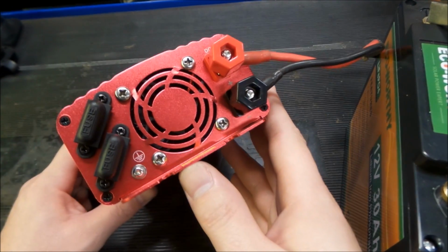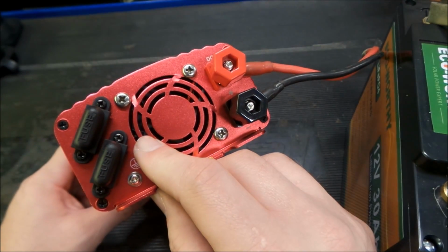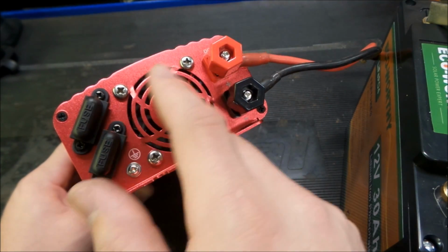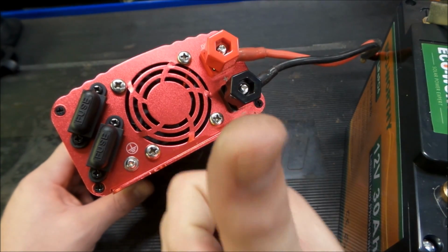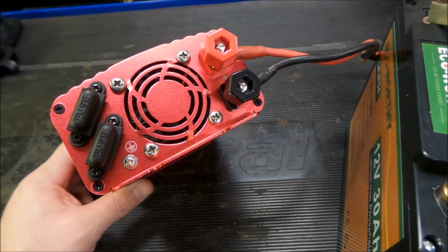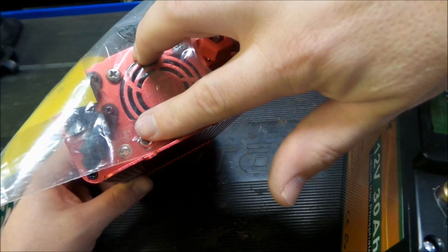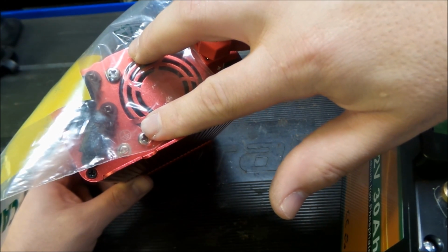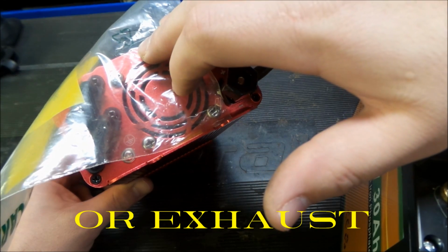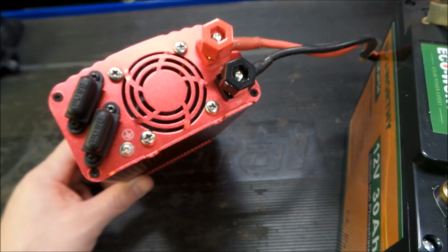Alright, so we have our inverter temporarily hooked up here with alligator clamps to the battery. And one way to tell is you can look in here at the fan blades, which you can't really see, but you want to see which direction the fan turns. It turns clockwise, and the pitch of the blade is facing out here towards the bottom of the blade. So that should mean that it wants to force air outward towards us. You can kind of test that by just holding a bag over this. If it wants to suck it fast while it's running, it's intake. And if it wants to kind of blow it out, it's outtake. So it's not sucking it fast. So that means this is outtake.